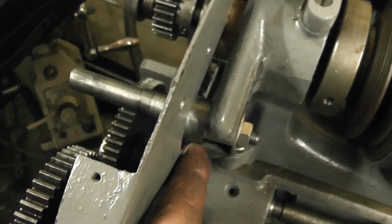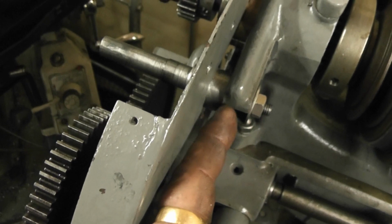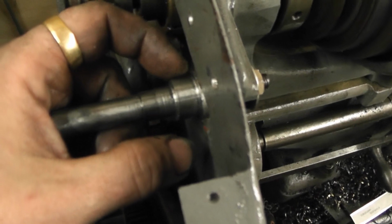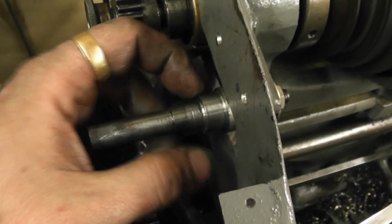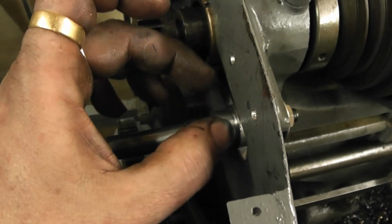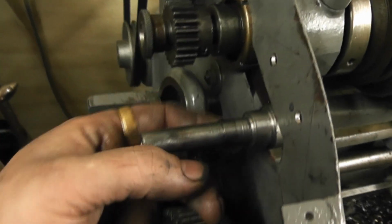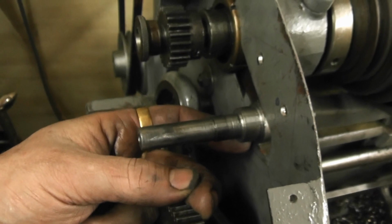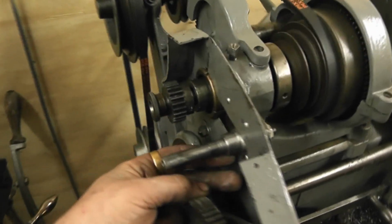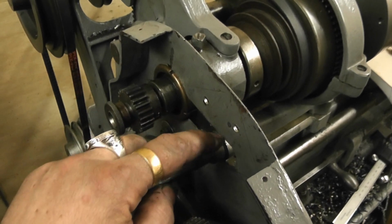That's fastened. The diameter there is obviously wider, so when you tighten that, it clamps onto these. For my design, the diameter goes down for the backer plate. Now the original design, the cheese wedge backer plate, just had one set screw, and that's probably why they're so hard to find, because people had realised it was a stupid design and hard to work. It should have been keyed.